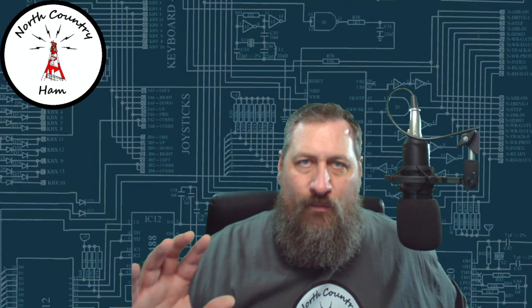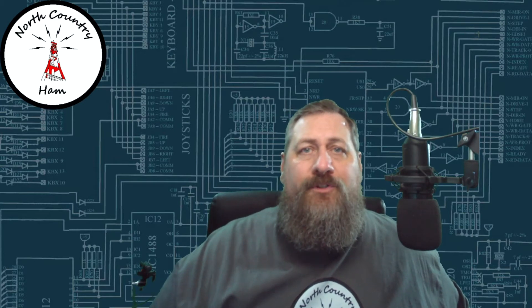I think it's getting pretty neat. I'm going to show you another little transition to a video clip where it's kind of trying to track a satellite. This was initial — just hooking it up, connecting the servos to the Arduino sketch and connecting it with Ham Radio Deluxe at the time — just to see if it's going to try to move. With nothing, no antenna on it, just to see if it's trying to move the servos at all. That was kind of neat — the first step to do. Then I'll show you the next part where we tuned the servos to point in the direction we want with the assembly. We've got it set up in the sketch so that when you first connect, it runs a full range of motion test. I'll show you that too.